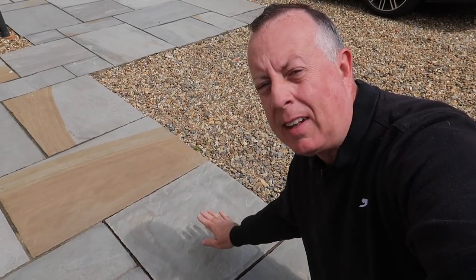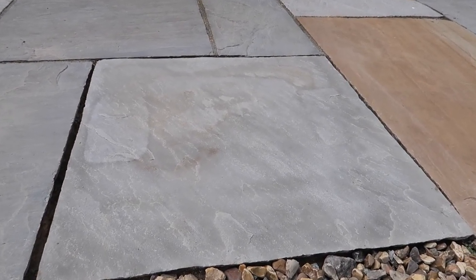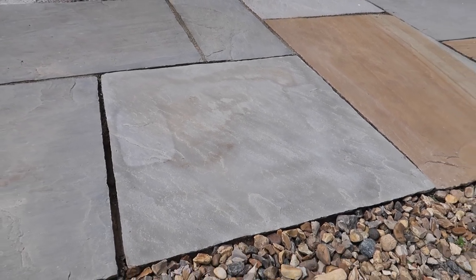Two days have now passed so the slab is just about fully cured — it's not wobbling anywhere and it's still in the right position, so I'm happy with that. Now if this was the only slab I was putting in I would grout around the perimeter using the same type of mix as the bedding mortar but fairly dry, finished off with something half-round like a broom handle. But I've got more slabs to lay so I'm going to wait until they're all complete then grout all of them using some polymeric resin, which is not a product I've used before. So if you're interested in seeing that, come back in a couple of weeks. I hope you've enjoyed this video — please check out the other ones on my channel and subscribe. I'll see you next time.